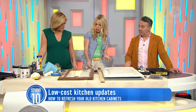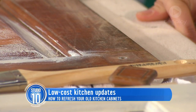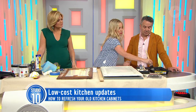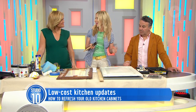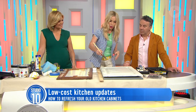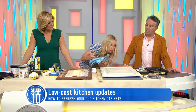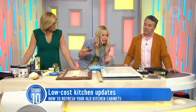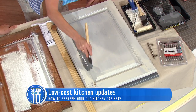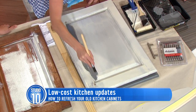For little holes where you want to change the handles, just fill them with wood putty, wait for it to dry, sand, and away you go. The next step is the White Knight laminate paint. What most people don't realise is that you can tint laminate paint to any colour you like — pink cabinets, grey, whatever you want. Once your cabinet is sanded and any imperfections are fixed, you just repeat the process and paint the laminate paint on.